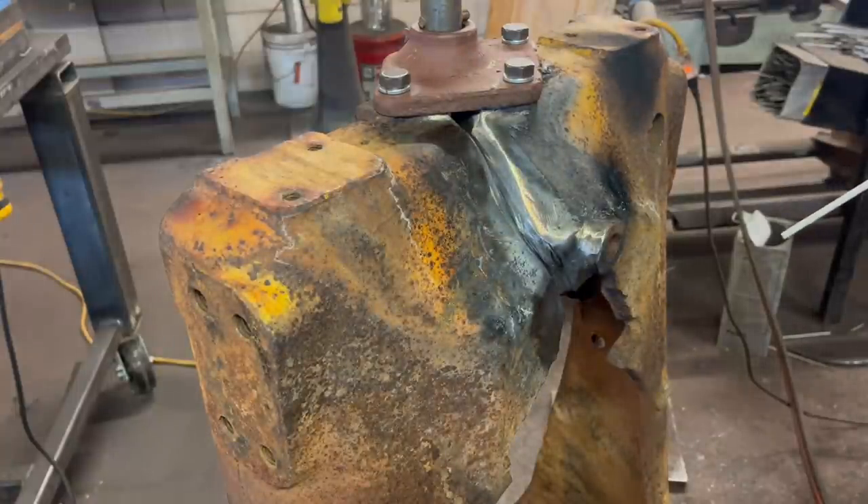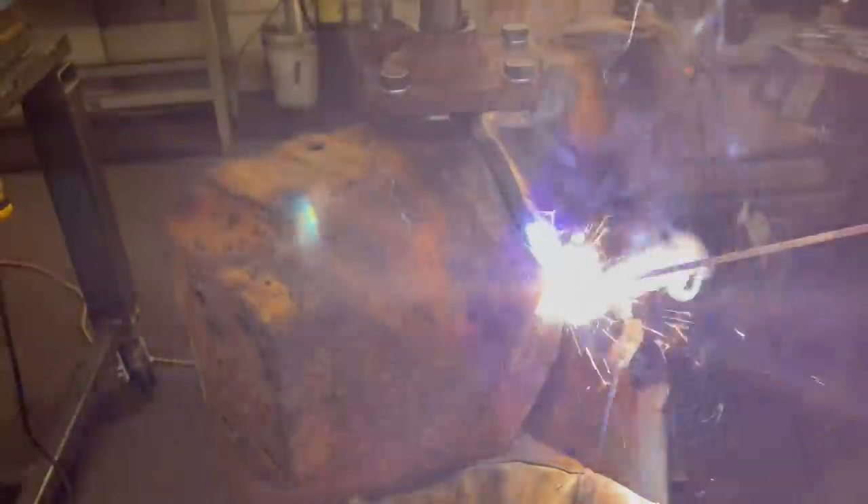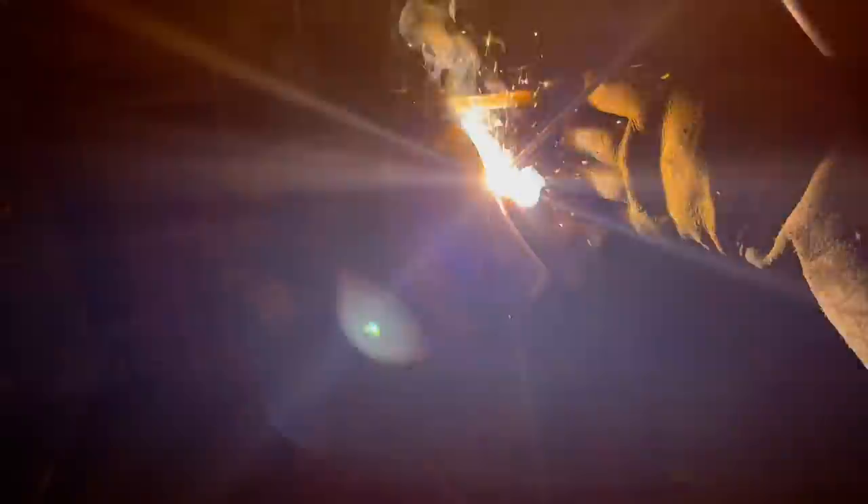The root pass is honestly a really critical weld — it's the backbone of this entire process. As I fill out this V-groove, I've got to ensure I'm getting that rod down into the bottom of that weld joint to put solid weld metal in the base. I'm holding a really tight arc, walking across any gaps, washing that liquid puddle from toe line to toe line, and making sure I'm backfilling as I progress with the 7018, maintaining proper rod angle perpendicular to the workpiece.